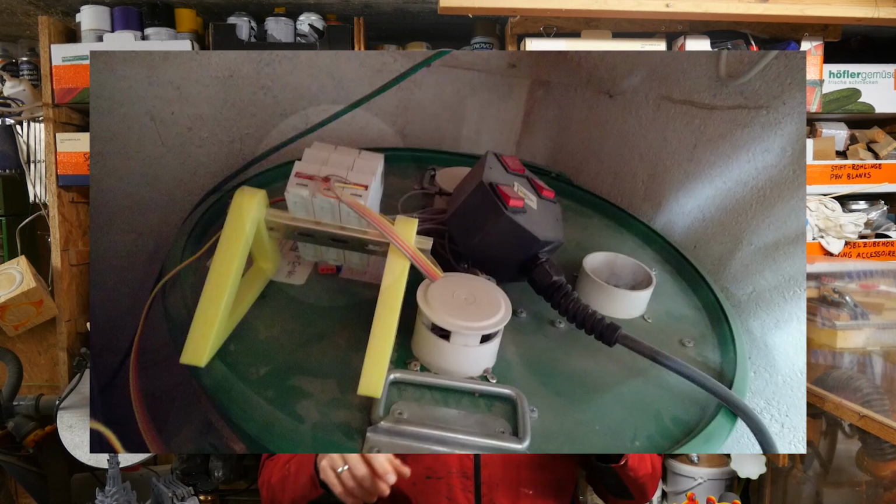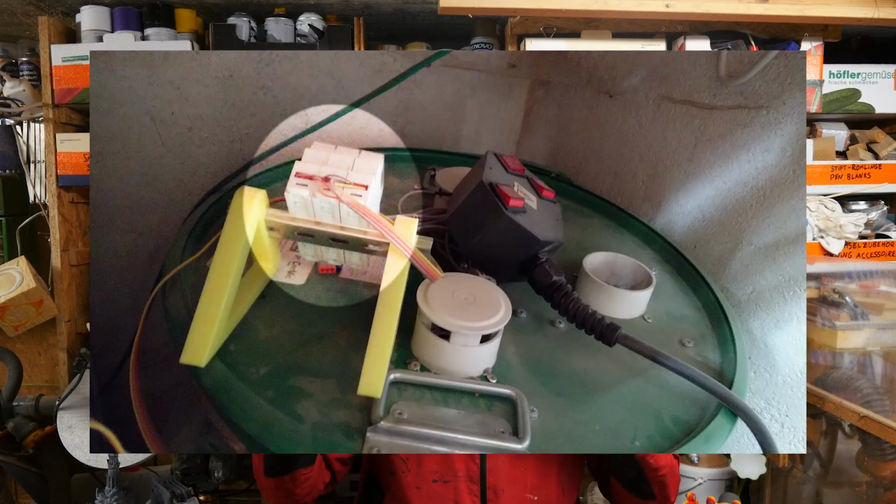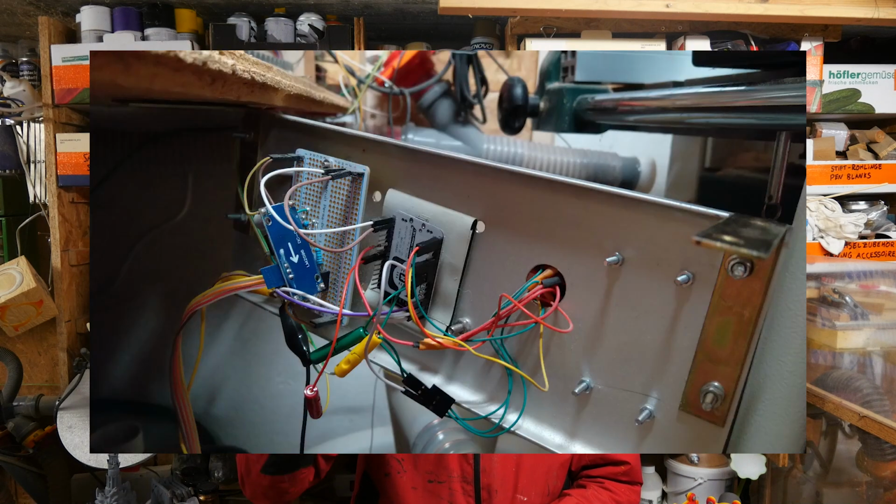Anyway, what I did, I took 3 relays that can be switched with 5 to 12 volts and that then switch 220 volts, the mains power we have around here. And then I took an Arduino-like piece to program it to do what I wanted. And long story short, what I wanted is to have 3 buttons. I will shorten that to 2 at some point.